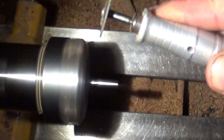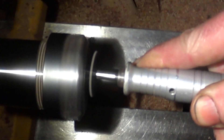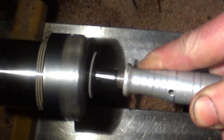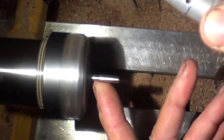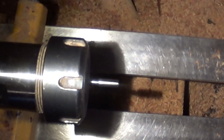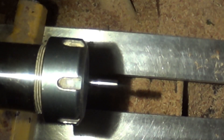Lathe on. You're working quite close to the collet cuff so be a bit careful there. Switch that off and then probably come in now with a file — yeah, that's nice. A little jeweller's file — that'll get me in there. Now I'm using my tool rest as an armrest to give my arm support.